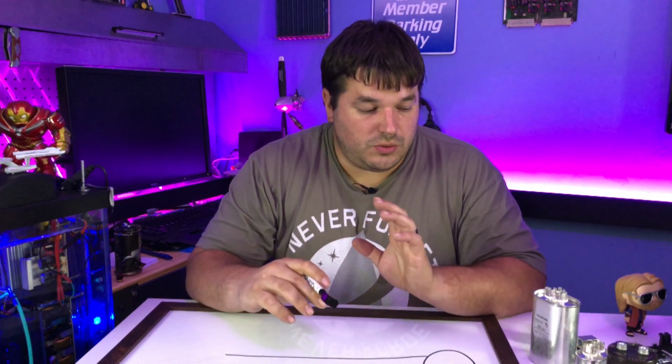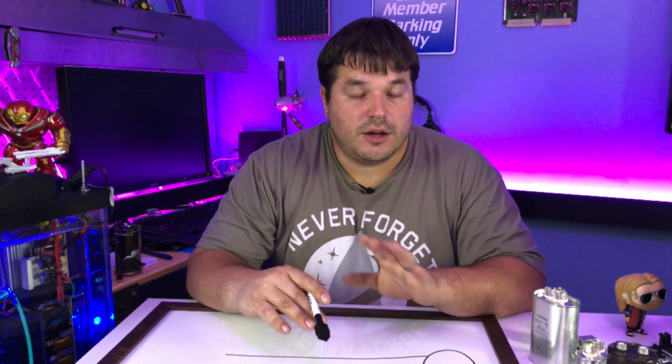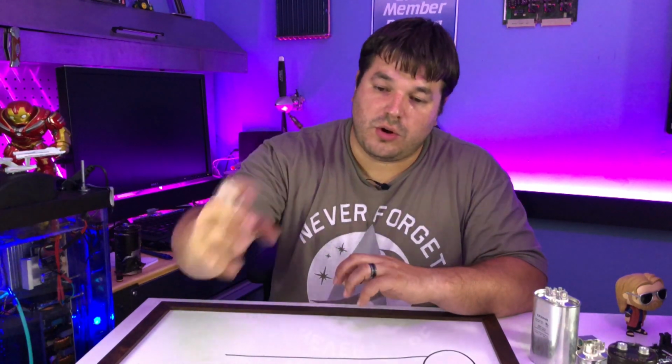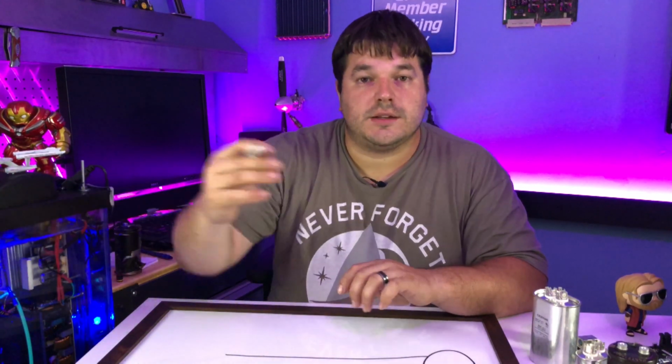These capacitors are actually used to create a third leg that's very weak, but gets the job done to create that third coil that keeps the rotor moving in the direction you want it to move. Even if it provides a gap so that one coil is stronger or closer than another energized, either way, it gets the rotor going in the right direction.